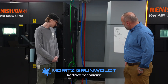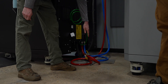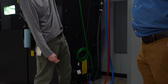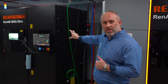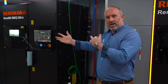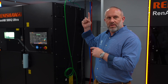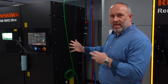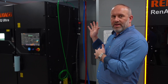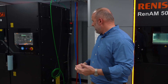Moritz walks through the chiller lines: red is warm water going out, blue is cool water coming in, and all lines lead upstairs where the chillers are located on the roof. The chillers are there because the welding process creates heat — the machine has an intercooler in the back that the chiller lines run through, so the argon passes through the intercooler and exchanges heat to the chiller, which then exchanges it to the atmosphere outside. Because these machines create heat and because we want to keep humidity low, we had to add AC — these vents overhead are an additional air conditioning unit. This space has two units right now, and as you add capacity you'll have to add air conditioning to keep conditions steady.